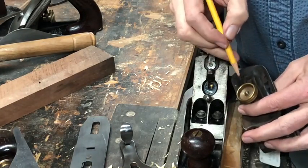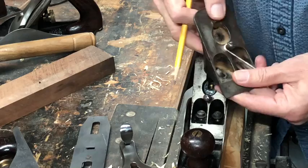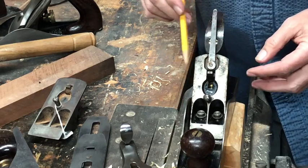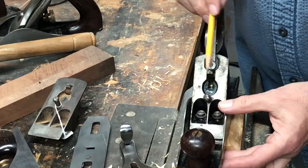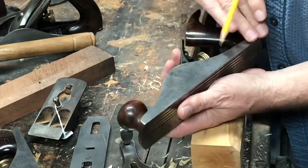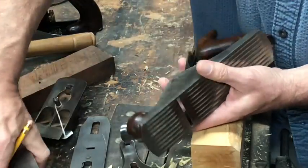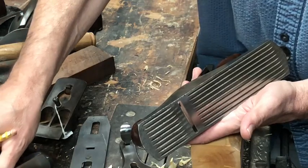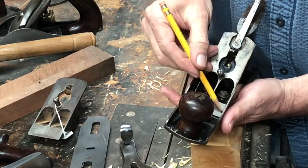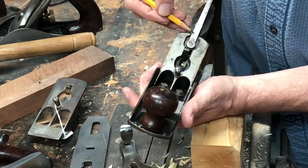On the newer ones you can see how much larger that brass knob is compared to the older one. On the oldest ones there's writing inside with patent dates — very collectible but not ideal to use because you don't have fine adjustments. This plane has the lateral adjustment and two screws that hold the frog to the sole. This is a corrugated plane — you can see the corrugations on the sole. Some planes are smooth bottom and some are corrugated; that's more of a preference. I have one of each.